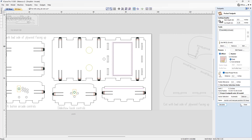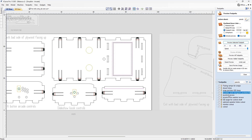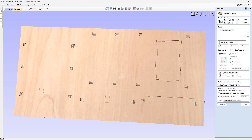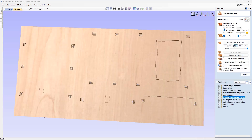Next up we have the joystick recess — for the metal plate portion that generally comes with joysticks, just to slot that in place, cutting down a very small amount on the underside of the control kiosk. Double-check your plate to the actual drawing and make adjustments whether bigger or smaller before you cut. Then there's a trim washer recess — just a washer area cutting down a very small amount.